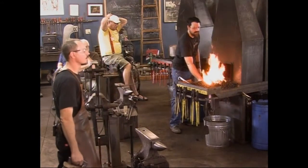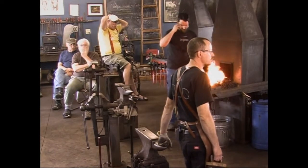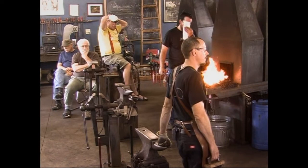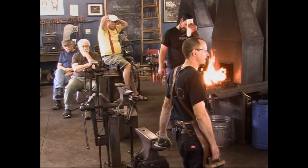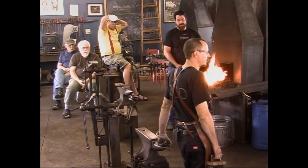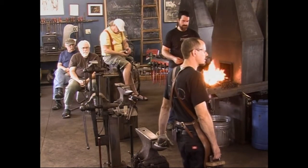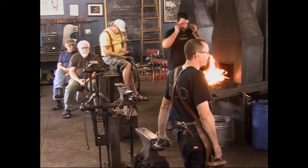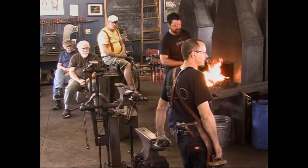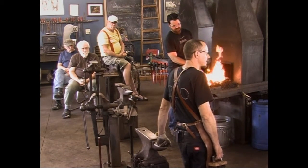Jen, what did you say this steel was? 4130. I looked the specs up on it, and then I disregarded them for heat treating. I believe it says something in there about quenching in oil, and it'll go nice and tough, not real hard. But if it's not too big, you can water quench this stuff, and it'll go fairly hard and still be real tough. It's not high alloy. It's like 4140, only less carbon. So it makes a nice tough steel.